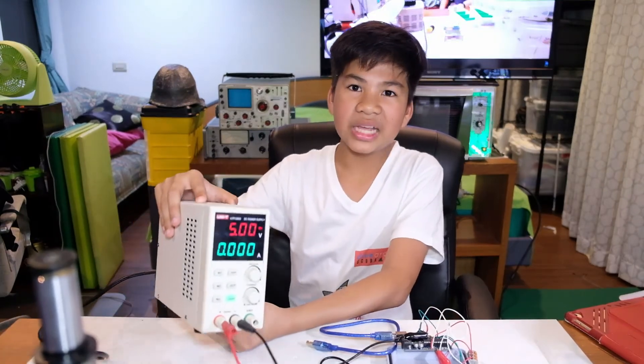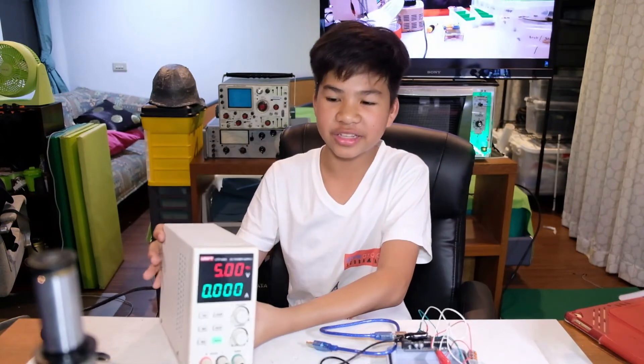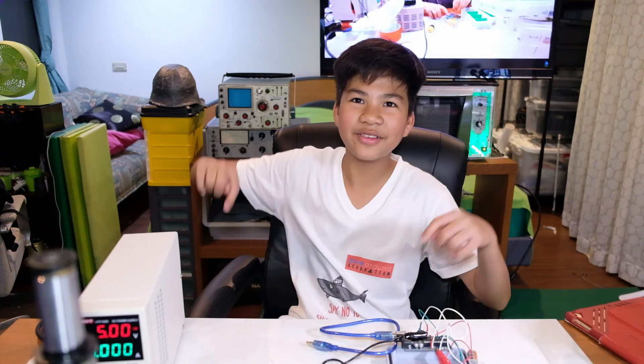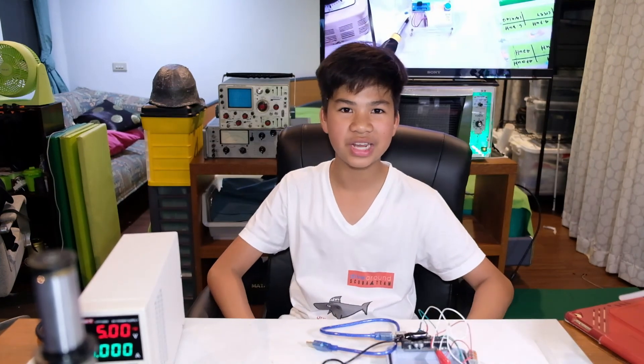Power supplies are very useful and are mandatory for every electronics hobbyist. They're not even that expensive — around a thousand baht. And if you can't afford one, you can make them out of AC/DC power supplies which have a set voltage, and use buck or boost circuits to get your variable voltage. We'll link a video in the description of people who have done it before. Thank you for watching — like, share, and subscribe, and stay tuned for the next video. Goodbye.